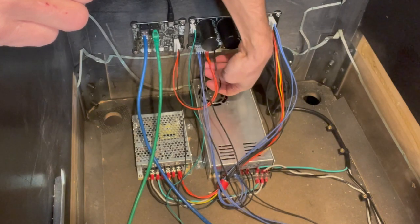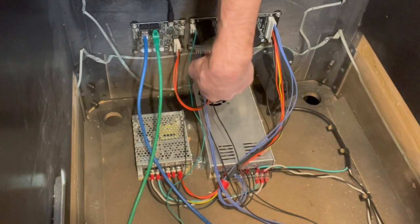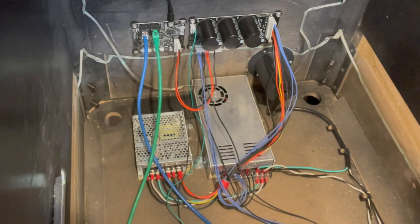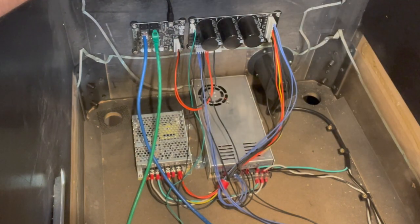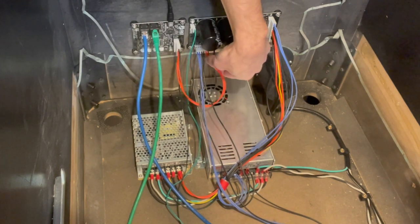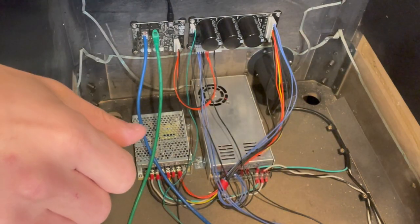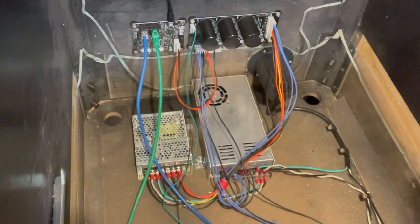We got that part right. But then we had a yellow line for our 12-volt power, coming out of the power filter board into our nano board. That is correct — we need 12-volts running to this board to power it. The nano board also has 5-volts coming in and connections for 5-volt to come out to power LEDs and things like that. But it doesn't have a 12-volt out. So the way I had it wired before, we had 12-volt coming from the switching supply to the power filter board, and it just dead-ended right there in the nano board because there's no more 12-volt coming out. We need 12-volt to be able to run our opto switches.